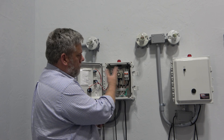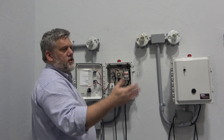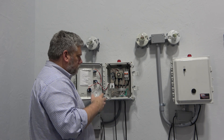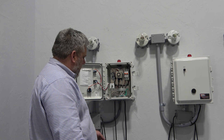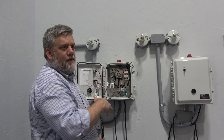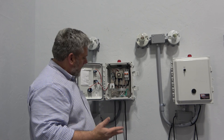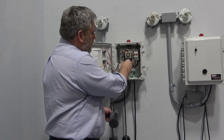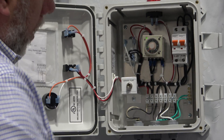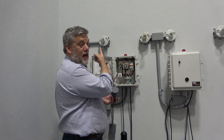You can have an aerobic panel set up alongside this — this is just a simplex, so you'd have this panel up front with a bunch of tanks and your aerobic panel somewhere else. This simplex panel also has an override float switch. So let's say it isn't set for the right time, or you have a high influx of water and you don't want water coming out of the tank. This override float switch — if I turn this off, so it's off now, even when the float comes up you can see the light is not on.